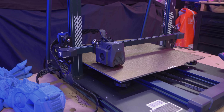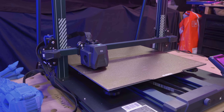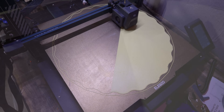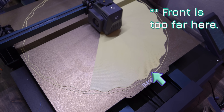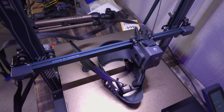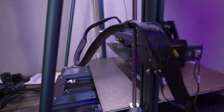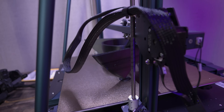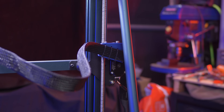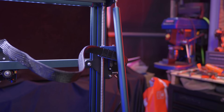But nothing's perfect — there are always negatives. The auto bed level sensor I mentioned earlier is a cheapy proximity sensor, and I truly question how accurate and repeatable it is. I definitely saw some points where the first layer was not perfect all the way across the bed — some areas a little too close, some a little too far. The auto bed leveling was compensating, but I question whether it was getting accurate readings to compensate from. A fairly big out-of-the-box issue is the ribbon cable going to the tool head — it only has a P-clamp to hold it to the gantry, and that's just not sufficient. It drags on the bed on the initial layer and can actually rip a print off the bed due to its sagging. I designed a mount that angles it upwards and holds it more effectively to prevent these issues — that's available for download at the link in the description.